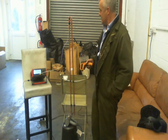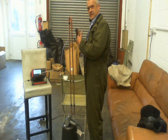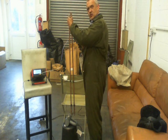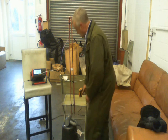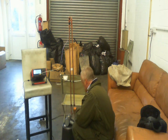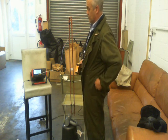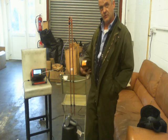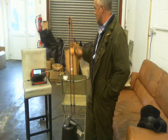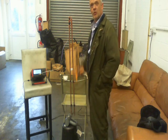It took 8 minutes to raise that to 55 degrees. What should happen is that as it continues to cycle through, the top will stay hot and the bottom will actually cool down. We're reading 31 degrees centigrade at the bottom and still 52 degrees centigrade at the top, so we've got quite a temperature difference. Now the thing to do is run the whole thing again with the thermal fluid pipe — I'll swap over the thermocouple and run it again.